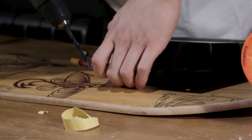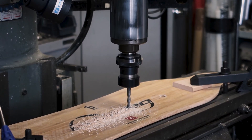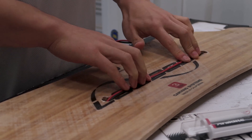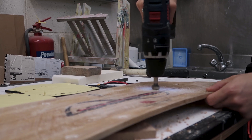To have the wires above the deck, you need two holes where the enclosures will be, plus a slot running across them if using the thick wires Ownboards provides. However, if you use thin braided cables like Boosted uses, you can skip the slot as they lay flat under the grip tape. In the workshop, I drilled small pilot holes where the wires fit through the deck under the enclosures, then increased the hole size until the XT60 connectors could fit through. I then milled a slot for the wires, used epoxy resin to glue them flat with the deck surface, marked the enclosure positions, drilled screw holes, and counter-sunk them flush.